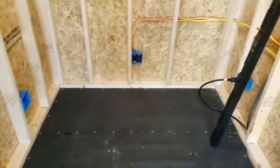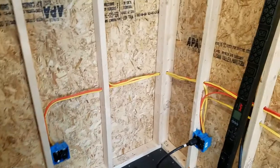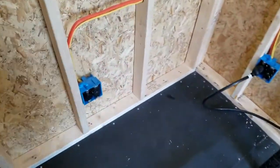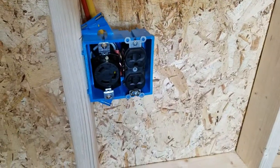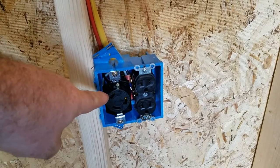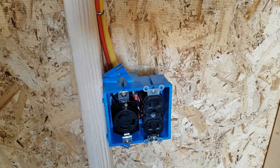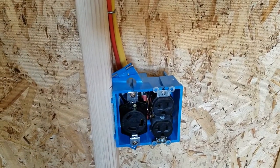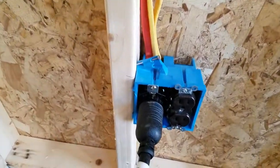A little more progress today — I wanted to go ahead and give you an update before I made the video, an update to an update. Got the first couple of runs terminated. It's NEMA L6, max 250 volt, 30 amp, and these are 20 amp 120 sockets, and those are going to be used throughout over here — same thing.